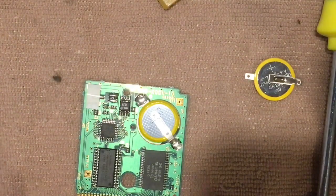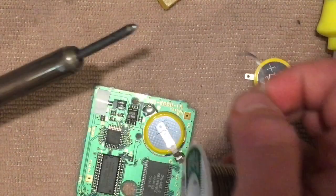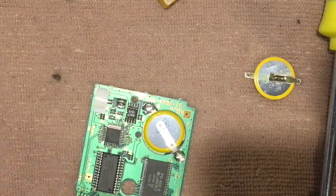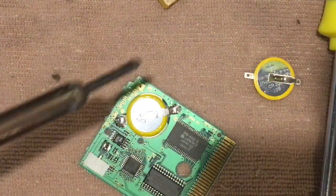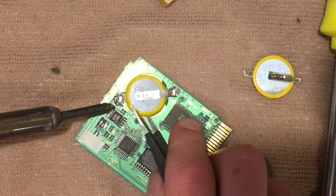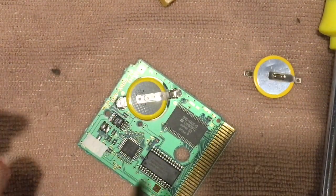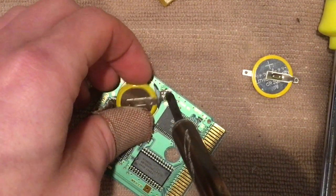First thing you want to do is heat up your soldering iron. When you think it's good and hot, the best way to test it is by taking a little bit of solder — it's called tinning the tip. You just touch it and if it melts right away, it's probably good. You saw the solder melt and smoke right away, so we are good enough to start. To desolder this battery is not difficult. All you really do is touch the solder to loosen it up and lift the battery out of place. I'm using these tweezers to get under the battery, loosening up the solder and lifting it up. I'm going to do the same thing for the other side — you don't even really need tweezers, you can probably use your fingers. Heat up that solder pad and lift it right up.